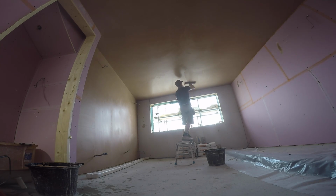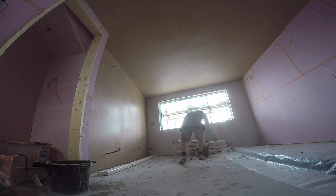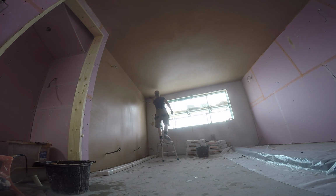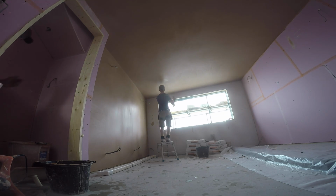The water will help a lot. I mean, you might get to it, the ceiling's dried a bit faster, so you might need water at the previous stage, but this is a wet trowel now. I'm using a Refina Superflex at this stage. The wall's taken up. It's a bit harder.